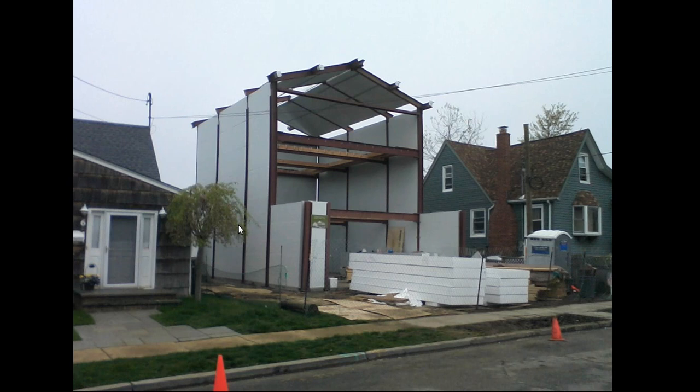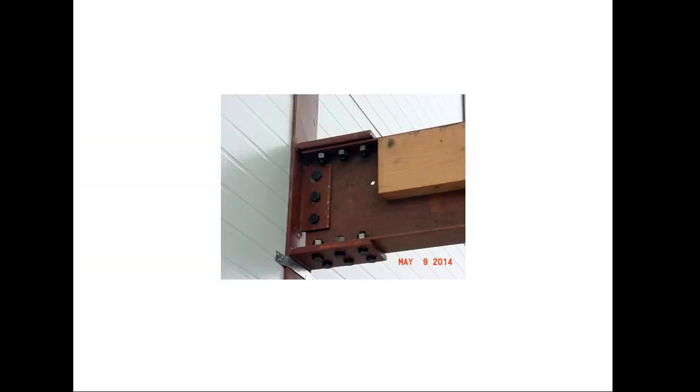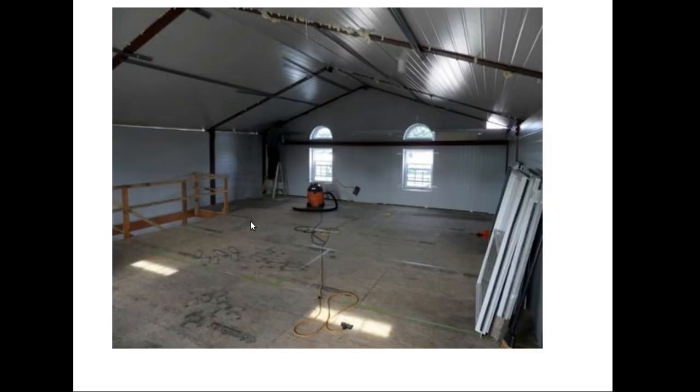Here the panel is being slid into the rafters on the roof, and this is a very strong floor-to-wall column connection. Here's the third floor of this residence. You can see the foam coming out — between the rafter beam and the SIP panel we inject foam into that whole cavity by drilling holes and filling the entire cavity between SIP and steel. So there's no air infiltration through the panel because it's a metal-based panel. Once you foam this joint and tape it, there's no air infiltration to speak of and you pretty much have complete control over air movement.